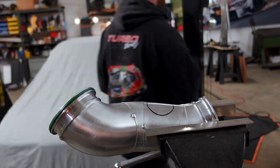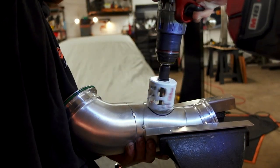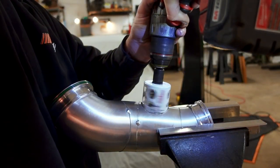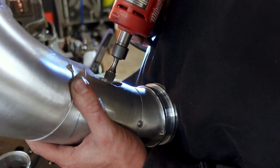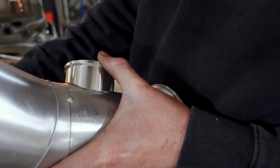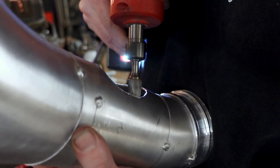But we're not done yet — we still need to place our blow-off valve on this thing. There's a lot of discussion about where is best to place a blow-off valve, but I've decided I want it as close to the throttle body as I can get it. Plunging a hole saw through this part was absolutely nerve-wracking, because I spent a lot of time on this thing and it would have been a huge bummer to mangle it. But thankfully I didn't encounter any issues, and after a bit of trimming and buzzing with an arbor bit, I got our blow-off valve flange to fit up nicely.